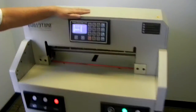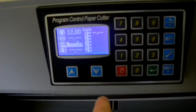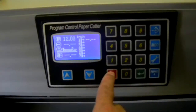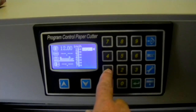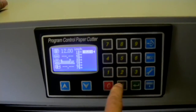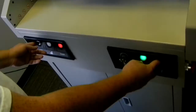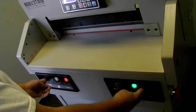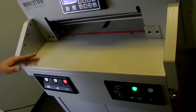I'm going to talk about manual mode first because that's the easiest and it's usually what the machine is set to. In manual mode you just have to type in every single cut you want. Since I'm already in manual mode, I'll hit C to highlight the cut position, and I'll put in 10 inches and hit enter. The blade will travel to the 10 inch mark. Now I hold both cut buttons down — I've got to keep holding them to complete the entire cut. After the blade goes up, it's done and you can remove your paper.